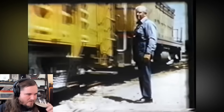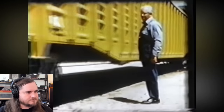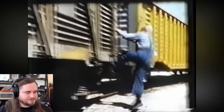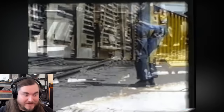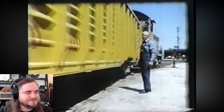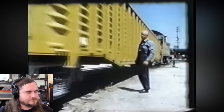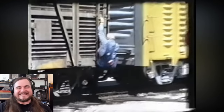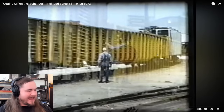Film: 'There's one right way to get on, too. Watch the outside ladder you're going to get on. Grab the rung with both hands. If the car's moving left to right, jab your left foot into the left corner of the stirrup and you're all aboard.' That's the whole point of those stirrups and why the boots you wear are the way they are. Jam it in that corner. Make sure you've got good firm footing. And there's a wrong way, too - here's going too far with the short but unsure foot. That makes every railroader watching just cringe. Not good. It's one of the reasons we talk about having a defined heel so you can jam that heel in the stirrup. Make sure you've got the right PPE - boots included.